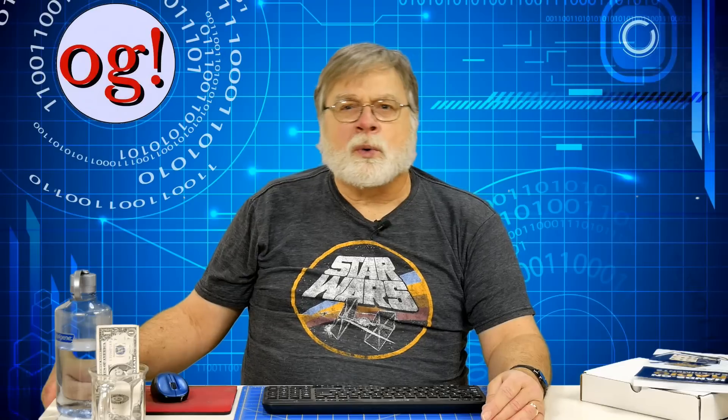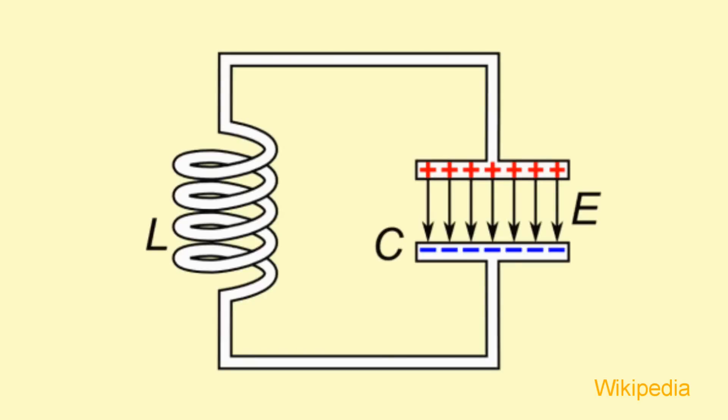That's a really basic approach to oscillation, but in practice it doesn't work at RF signals. So a different technique is used — for this I show you the tank circuit. A tank circuit is so named because it can store energy, although on an entirely different basis than a battery. A tank circuit consists of a capacitor and inductor, usually in parallel, as shown here.